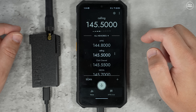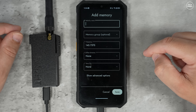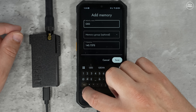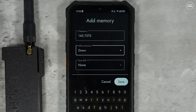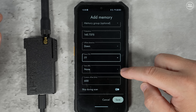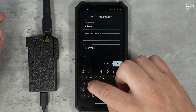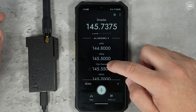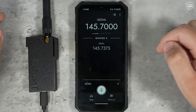To store a repeater, simply enter the repeater's output frequency at the top then press the plus button to the right of the PTT button. Here you can enter a memory name — if it's a repeater, why not name it as the repeater's official call sign. Repeaters use an offset which you can set here, and most modern repeaters also use CTCSS to access them, which you can also set for the memory channel within the app. Under the advanced options you can change the offset — the split between transmit and receive. Most VHF repeaters use a 600 kilohertz offset, at least here in the UK. You can also assign a memory channel into a group; for example, all repeater memories into a group called 'repeaters' and simplex gateways into a group called 'gateways'.